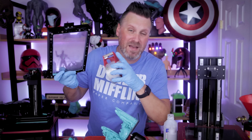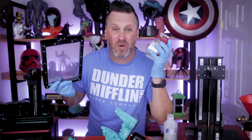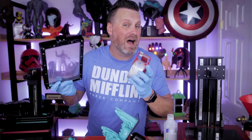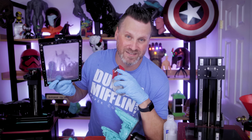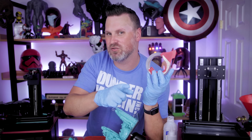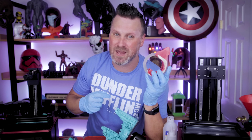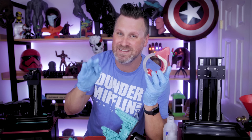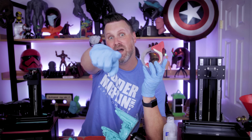So if you end up with a pin-size hole in your FEP sheet and are in a pinch, this clear packaging tape trick will work. For how long? I don't really know, but I was able to get about 10 hours worth of printing off of this before replacing the FEP sheet. Let me know in the comments if you have any other suggestions on what you could do if you're running into issues with your FEP sheet before fully changing it out. I thought this clear packaging tape idea was a quick, easy, and effective solution. Thanks so much for watching — I'll see you next time. Bye now.